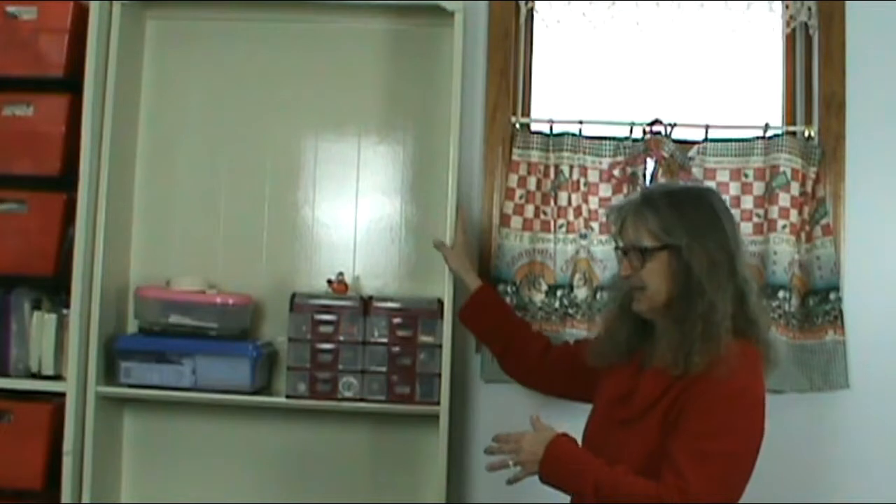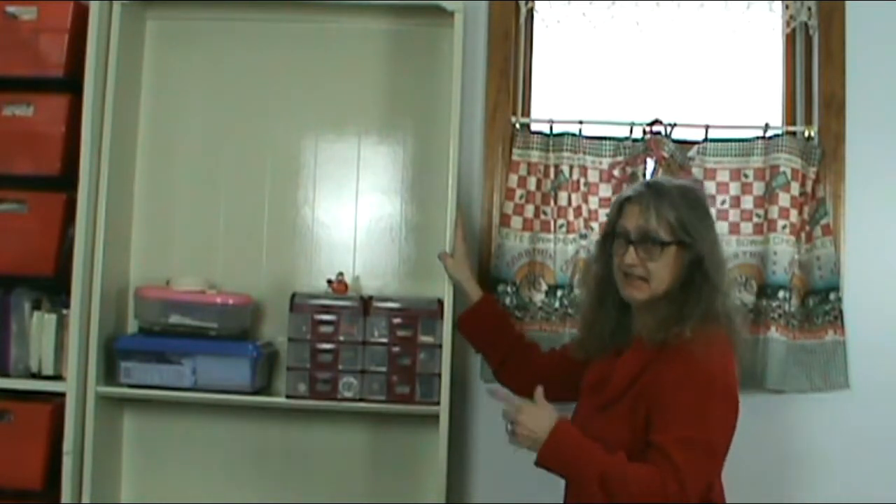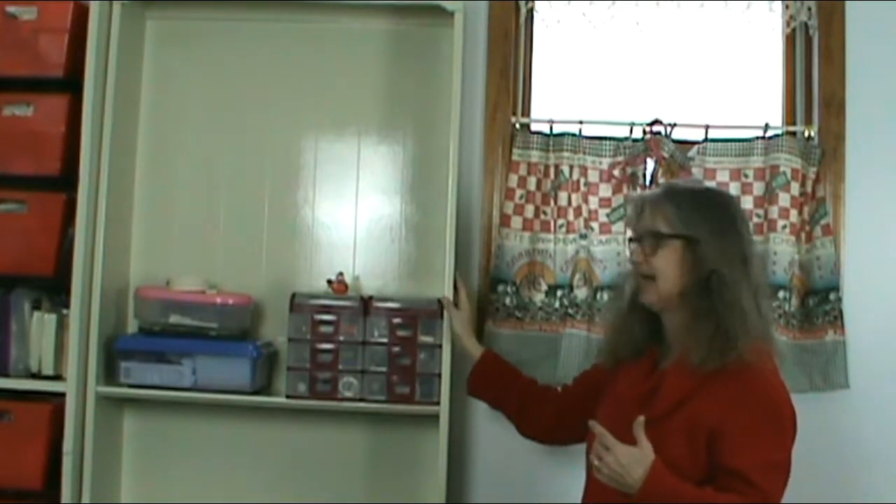I haven't got the whole four pieces done. I've still got pieces downstairs that are drying and I'm hoping to wrap this up next week. But I want to explain — on these cabinets they were covered with a lacquer or shellac, and I had to sand them lightly so that the paint would adhere. Then I took Zinsser primer and then I used an oil-based paint.